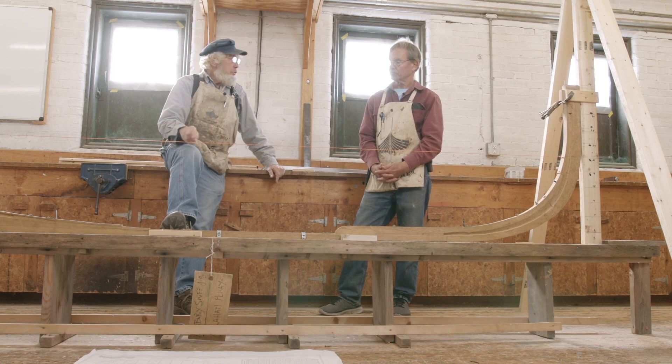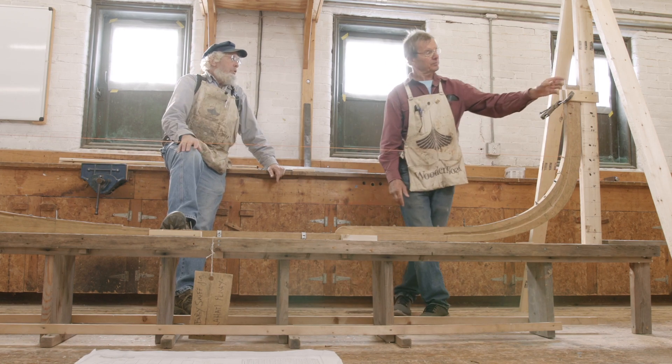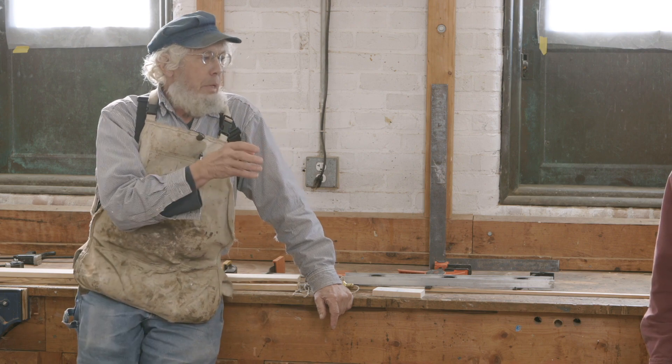We have our keel. When we bring our keel over, we have a centerline on the keel — check and make sure that it is really there and it's true. Then we have a centerline on our strongback, so that's true. The easiest thing to do: clamp up your stem, like it is right here. That's going to hold it plumb.